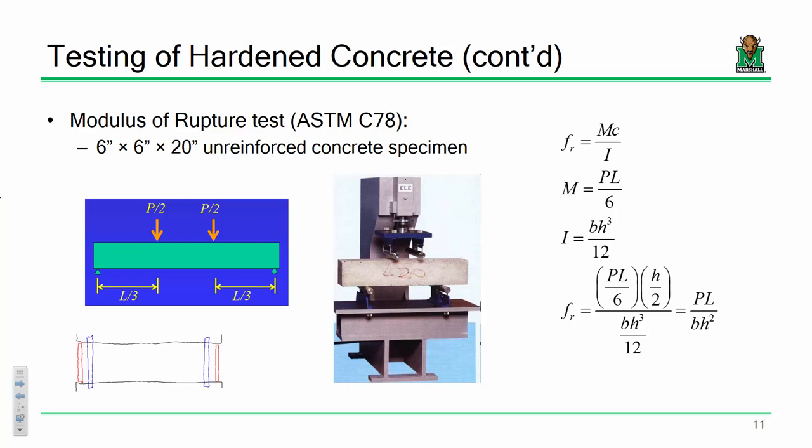Now what's the problem with that? You encase the screws in the concrete. So the plates need to go on the inside. There were two groups out of six that did that. So make sure you put the plates on the inside. It wasn't that big of a deal. It took us 10 minutes.